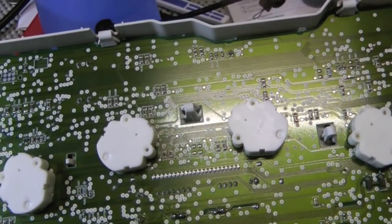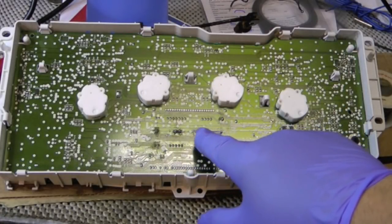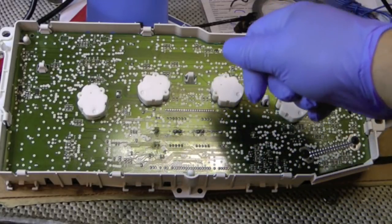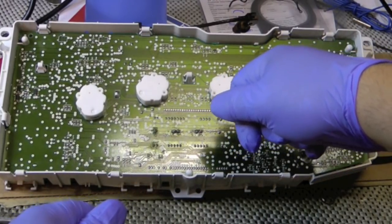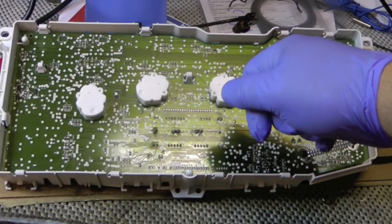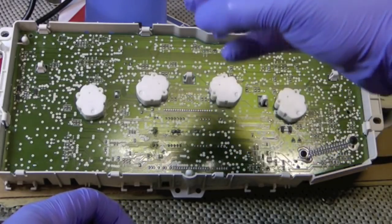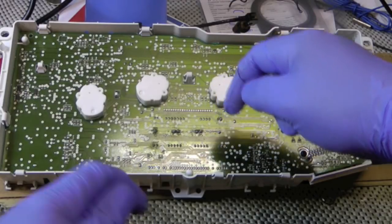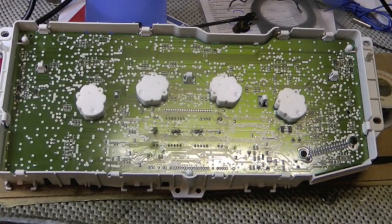I'm going to show you now there is continuity. To touch these up, I really recommend you put a little bit of flux — just a little bit — and then take your hot soldering iron, touch it to the post, and touch a little solder to it. If you have really good eyesight or do this under magnified light, you'll see the flux kind of bubble up and then it'll pull the solder in. Once you see a good solder connection, you're done — move to the next one. Then you can clean this up with some 99% isopropyl alcohol.